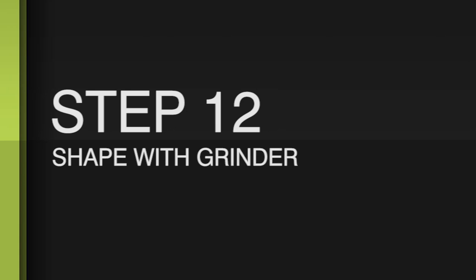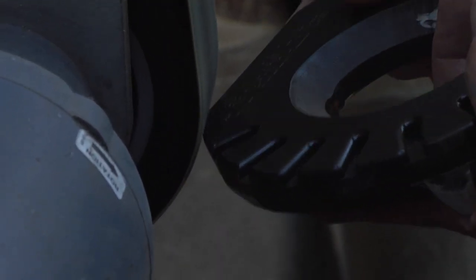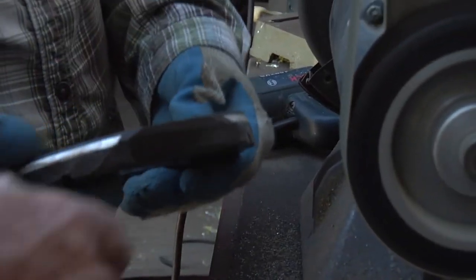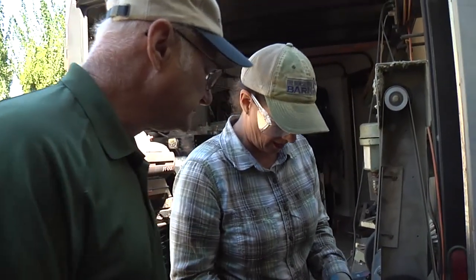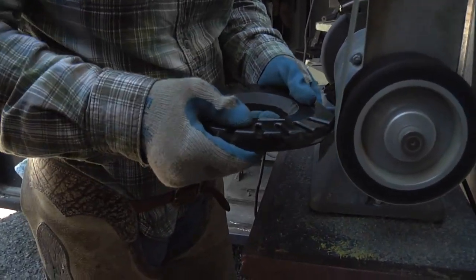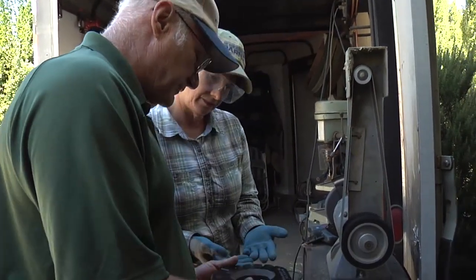So now we're going to take it to the grinder and I'll let you do some of this. I'll shape one side and show you the kind of fit that I want. Generally I'm tight to the line and then I'm loose to the line through the back heels, just like you would shape if you had a shoe on. Now what you do is just round this corner up — you want a radius on all your edges.